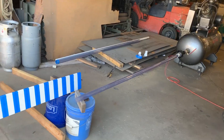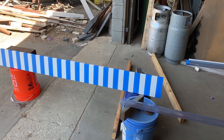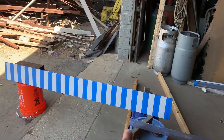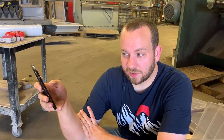Our barrel stayed on and we were at full pressure. The bullet got wedged in, and we're missing about 50% of the paint. In the high speed, it makes the bullet look like it's shooting way out there, but our board was kind of sloped down and the barrel did rise a little bit — we still hit the board in the middle. We doubled our feet per second from what we saw inside the barrel: 150 feet per second to 298, which translates to a muzzle velocity of 203 miles per hour for that big steel slug — which has a lot of mass, so that's a ton of force. The eggs will not be going that fast, and I think if we try to make eggs go that fast, they're going to explode.